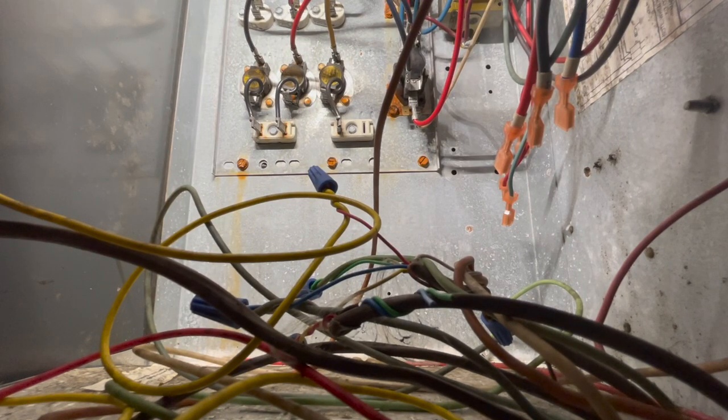So I have the new board here. Again, these are very cheap. So I keep like two or three on the truck. It just makes everything plug and play. Now in a pinch, on a weekend, when I haven't had one of these, I've used the Honeywell, that brown, what is it? The 97, I can't remember the part number, 9730 or something like that. I've used that to replace this board. But I like to try to stay OEM. This thing's got a time delay built into it and all that. And again, they are so cheap. Well, we have Johnstone now, thank God. I keep about two or three of these on my truck, so it's not a problem.